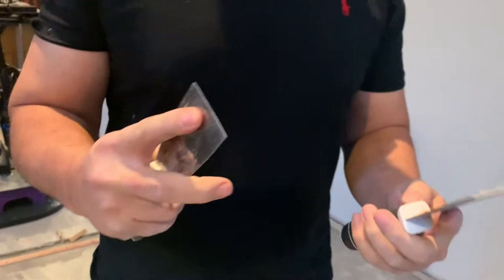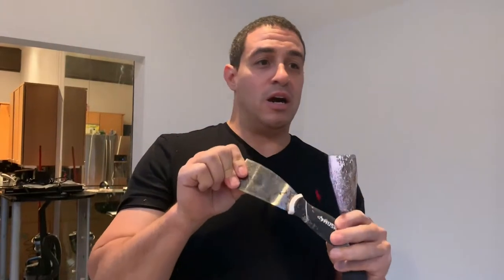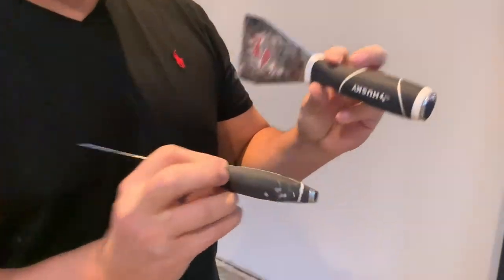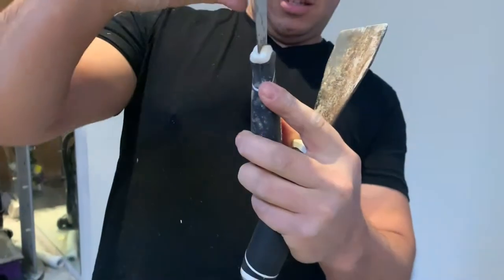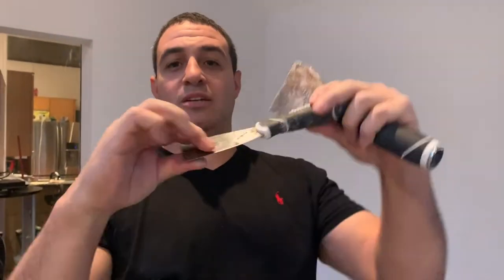A quick thing to note — we have two pry tools here, both made by Husky. They both look similar and are multi-purpose, but one is more like a putty knife, good for spackling holes and getting behind something without creating much damage. The other is better for prying or removing something more difficult. One way to tell them apart: take the blade and see how easily it moves. If it flexes easily, it's not going to be a good pry tool — you'll bend or break it.